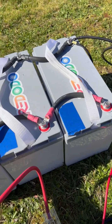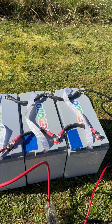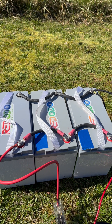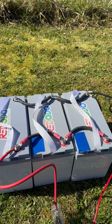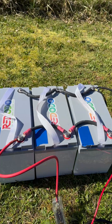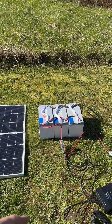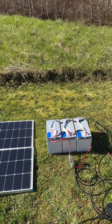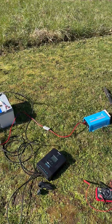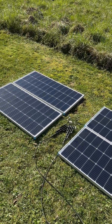The neat thing about these batteries is we can pull them down to literally 99% discharged and still have 2,500 cycles of life. If you pull them down to 80% depth of discharge — the factory recommendation — you get about 3,500 cycles. Conversely, if you take a lead-acid battery and run it down to only 50% depth of discharge with 50% still in the battery, you get 500 cycles. At 50% depth of discharge, lithium iron phosphate batteries do 5,500 cycles versus 500 for lead acid — this is why we're going with lithium iron phosphate.